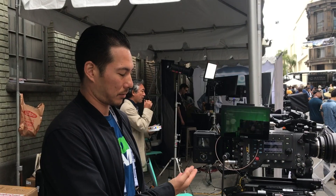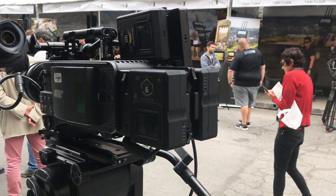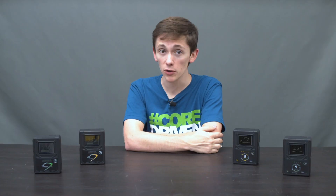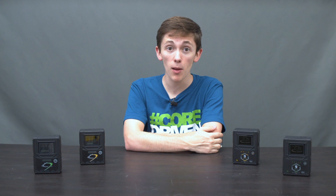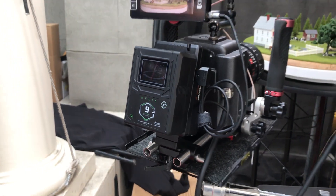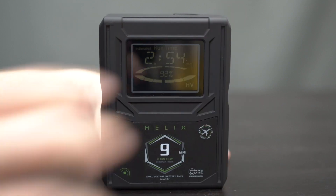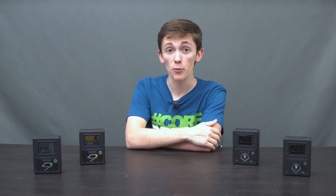Camera-wise, Arri has already stated that the next iteration of cameras in 2020 will be high-voltage operable only. So if you're considering a new battery purchase, you may want to look closely at the minimal price difference and buy the Helix. If you're not using high-voltage equipment yet, you can still use the Helix to complement your current fleet of battery packs. And once you invest in a new high-voltage camera, you just need the mount plate to get up and running. The packs will work on both high-voltage equipment and standard-voltage equipment.